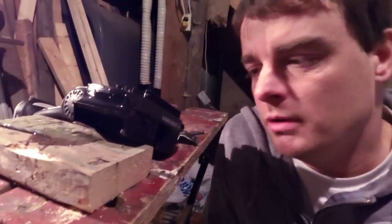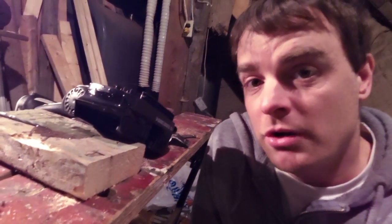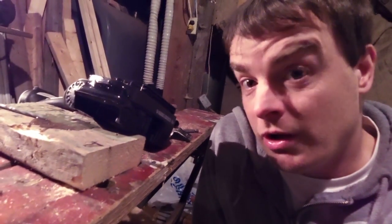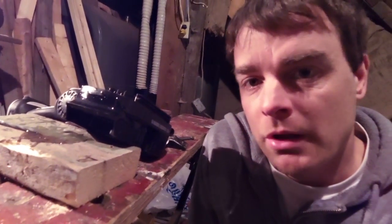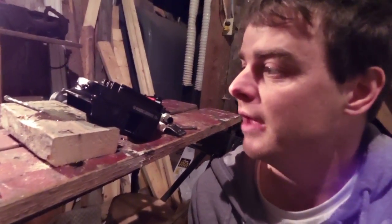Just as a summary while I'm waiting for the epoxy - I've got some two-part epoxy on there, just waiting for it to solidify so it really makes one solid piece. The biggest problem I had was the soldering - my solder guns were just not up to the task. The solder on the circuit board must have been some super hard Chinese solder. Once I got my little butane torch - once I found it in my shed and got it working - I was able to do the soldering and proceed.